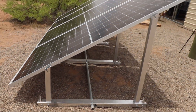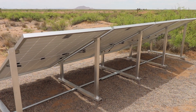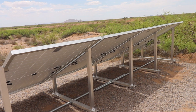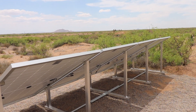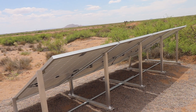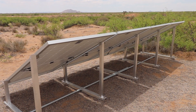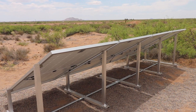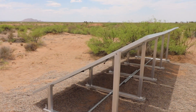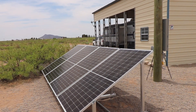I could certainly do it in half the time now, after having done it once — it didn't even take that long initially. And now we've got some shade under there. I hope you enjoyed this video and that the Integra rack will be helpful to you for mounting your solar panels. They have a whole variety of different models to choose from for ground mount and different mounting systems. They're also coming out with ones that are adjustable angle — whereas this one, the IR-30, is a 30-degree angle. For my area, about 26 degrees is the optimum, so this will work great. If you enjoyed this, please like, share, subscribe, and give me the old thumbs up. This is the Homestead Handyman, out.